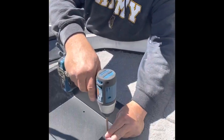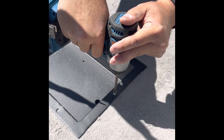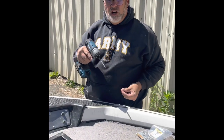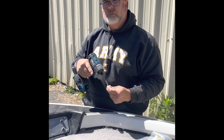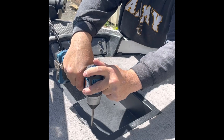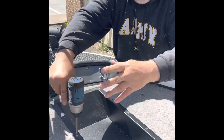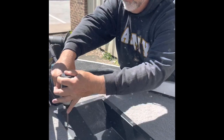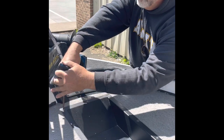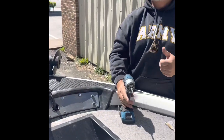Some people are wondering, aren't you going to break the screw using an impact? So look — the impact starts to go and it starts to get very difficult, so what I'm going to do is actually pull it back out and drive it right back down. It'll send it right through. You can choose to send it fast and hard and risk breaking that screw, or you can just get it down a little bit, let that impact start to hit it, back off, and then go right down. If you start running into any resistance, stop immediately. Back it off and then go right back in.